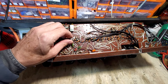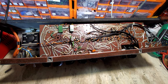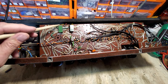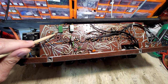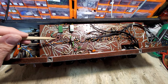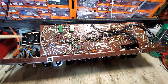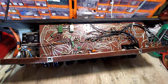I'm going to have my hands full sorting this one out - it's going to push me to the limits. Being a PCB like it is, it's just going to take a long time to get right and repair. We've got these components that have been tacked on here and a dead-end trace by the look of it. There must have been something here originally because there's so much flux around these holes - if it had come from the factory like that there wouldn't be any flux around it.